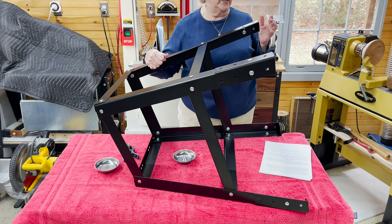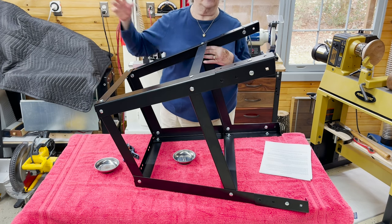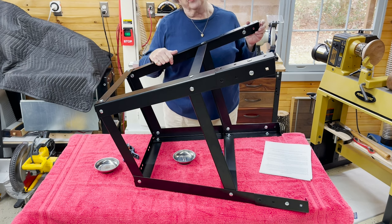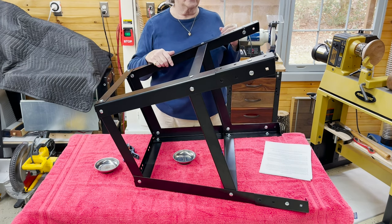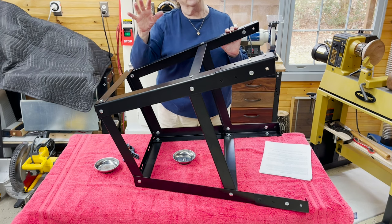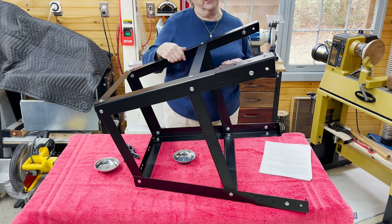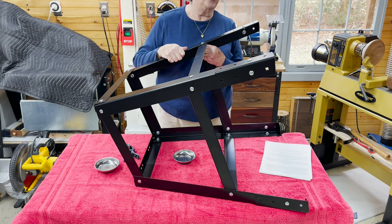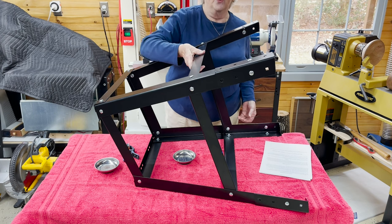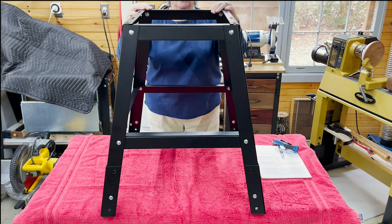One last thought: I want my stand to be on wheels so I can move it where I want it. Some days on pretty days I take it out on my deck and use my scroll saw, so wheels are really helpful for that. If you're going to use wheels, put taller wheels in the back of the saw and shorter wheels in the front so that the saw will be slightly tilted towards you — that will decrease the strain on your neck. I'm going to turn it right side up and tighten these bolts down. There are 24 of them, so count them and make sure you get all of them. Now the stand is all put together, all the nuts and bolts have been tightened. Happy sawing!